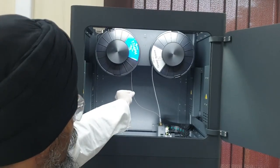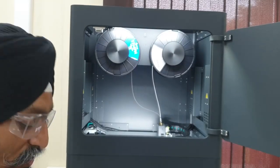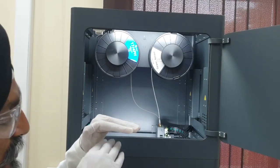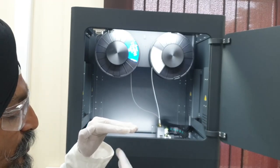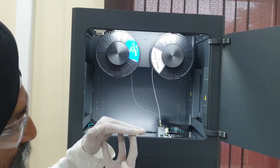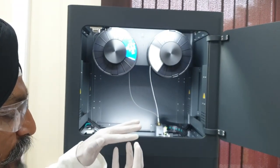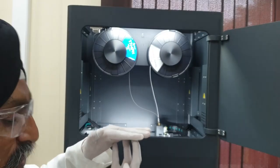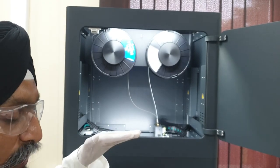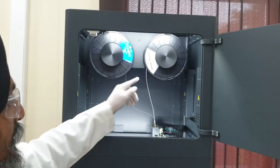This is a stainless steel filament. For metal 3D printing, suppose a cantilever kind of beam is to be built — it has to have supports in between because it cannot be held in place on its own. We have to build certain supports. To remove these supports so that they don't become part of the final print, we have to put some coating in between so that it is removed easily. When put into the washer, certain support materials are removed. After sintering they should also remove. For that, a certain parting material is used — that is ceramic.